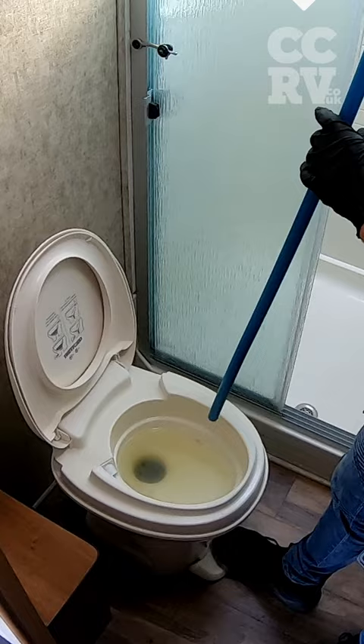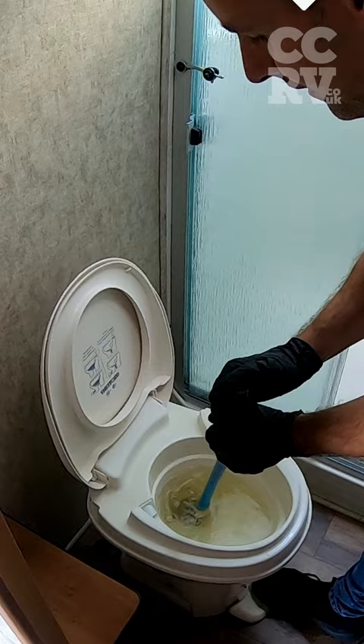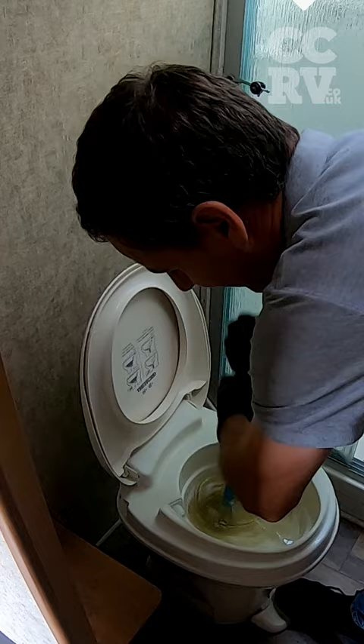It's not just a case of ramming it — we're going to slowly feed it around. You can see the bubbles already coming; you can feel the U-bend. Just keep a little bit of pressure, and don't forget to keep your finger over the top of the pipe, because it will act like a plunger and you'll get it on your ear. So just feed it around slowly, turning it as you go.